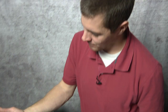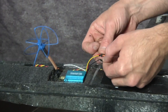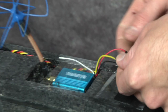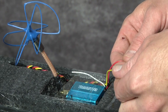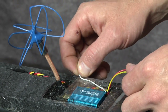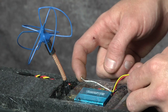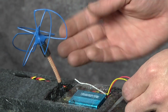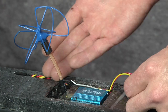What about the video transmitter? There it is back there. Again, servo leads: red for power, black for negative, yellow is signal. Now, what about this white wire? I've had this white wire that I don't seem to say much about — that's for audio. White is always audio. Since I don't fly with a microphone or audio, I simply don't connect it. Some people will ground it; I just leave it floating.